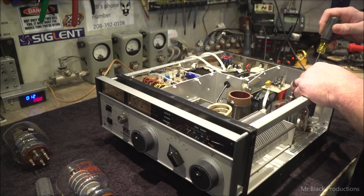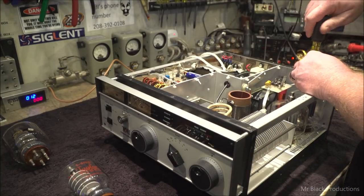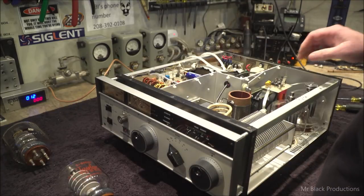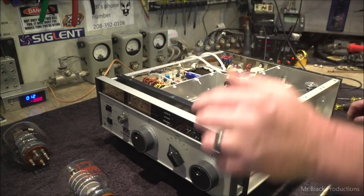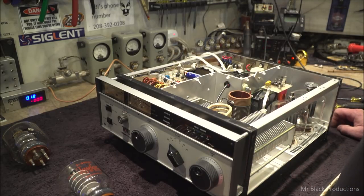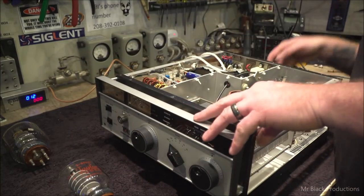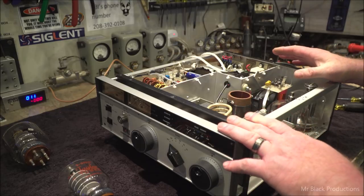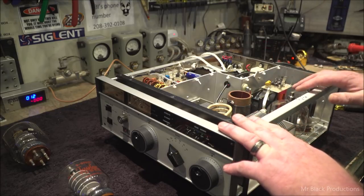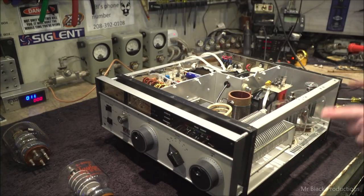We're going to bend this up out of the way. And we'll bend this up out of the way. Get rid of the dead man switch. And then there should be another pressure switch someplace we've got to override. Yep, down here. I'll override this switch. And then what we're going to do is light the amp, but without any high voltage on the anode or the top of the tubes. None. And we're going to sit here and watch the tubes light up, and watch what they do.